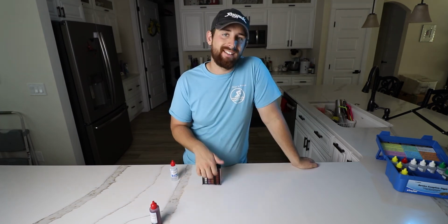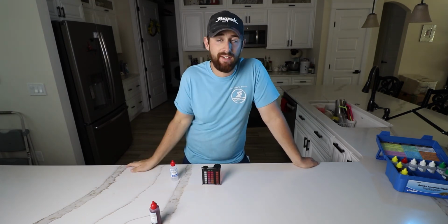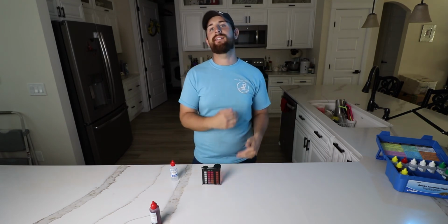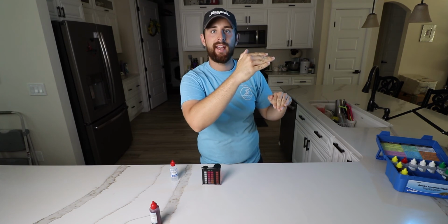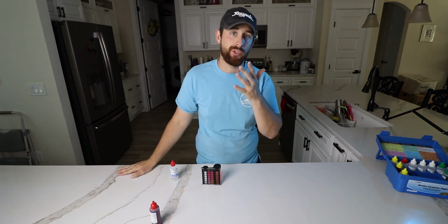If you used 1 drop and it didn't get you to the ideal pH range, say you're still sitting at 7.8, you can put in another one, and again, in the back of that book, it has a chart where you can see it took 2 drops, you can go to 15,000 gallons, meet that point in the middle, and it will tell you just how much acid you need in order to adjust the pool.